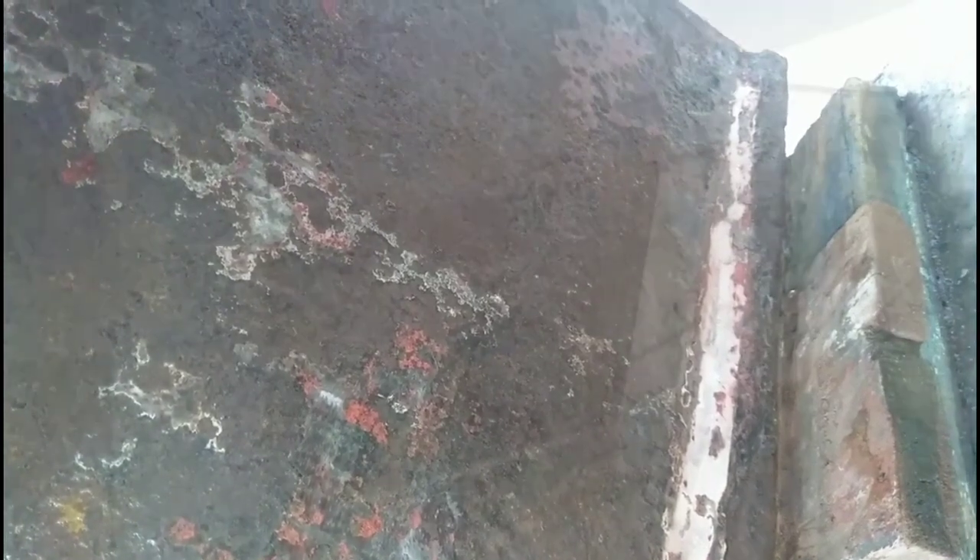This is the inside of the bilge keels and it's just such a difficult working environment. I'm not too sure whether I can do this myself — I might have to get someone in to grit blast it or whatever they do. I just don't think it's going to be clean enough for epoxy. We'll do the other side today anyway and see what that comes up like.